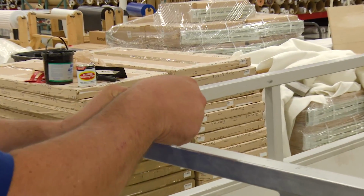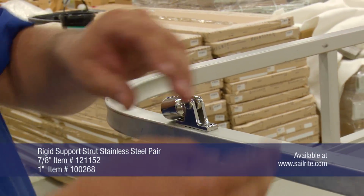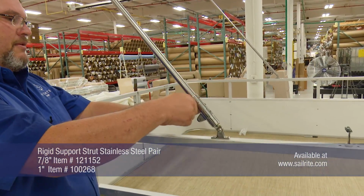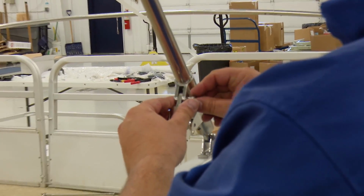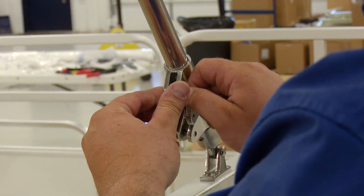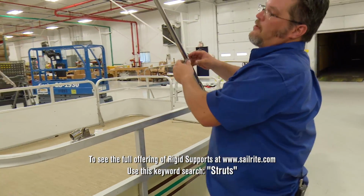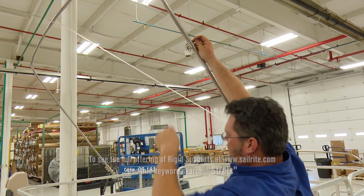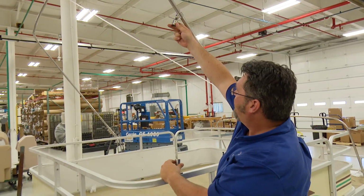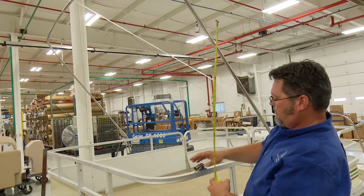If you plan on using the 4 adjustable webbing straps in lieu of rigid support struts, simply use the filament strapping tape to secure your frame in place, following basically the same principles here, except for here we're using a rigid support strut. We'll be showing using the filament strapping tape in the Adjusting Primary and Secondary Bows chapter coming up soon. Okay, and we'll be able to move this around once we're set. What we want to do right now is just get it so it's not quite vertical, but close. And now we can take a measurement.